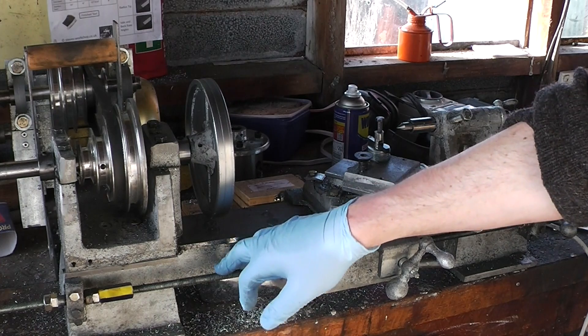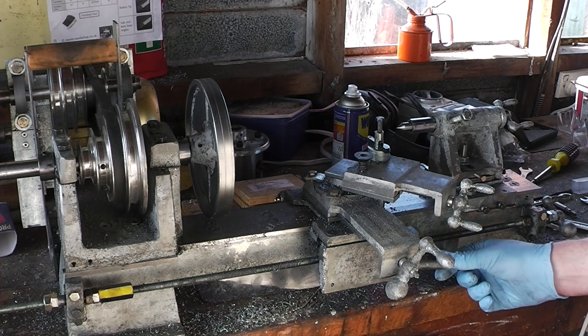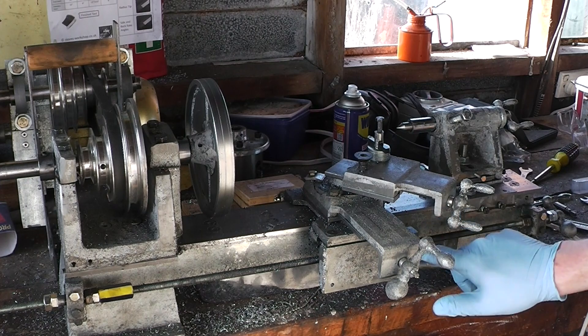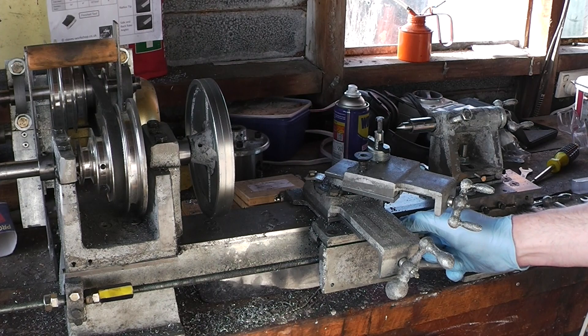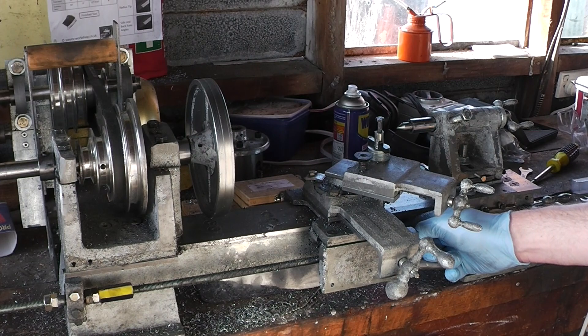Once we've got the lead screw on, we can do the half nut. The apron is one of the simplest castings, but the half nut behind it is one of the worst castings, because you'll be casting it on a length of steel threaded rod to form the threads in the half nut, and you will have the devil's own job of getting the threaded rod out of it. Lots of patience and a good Dremel tool is what I recommend.